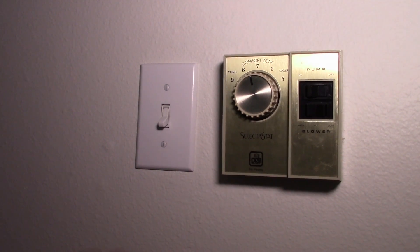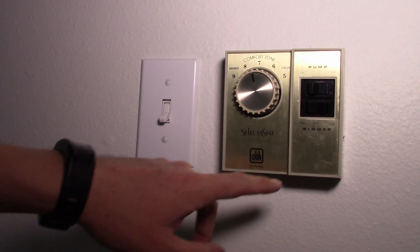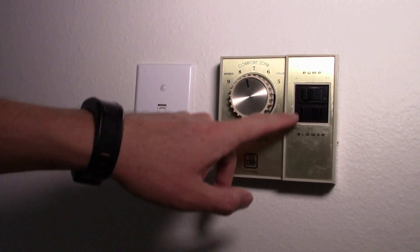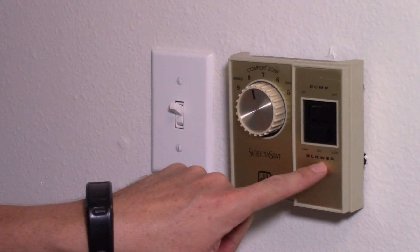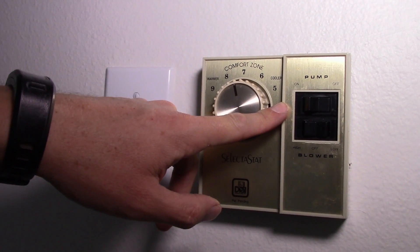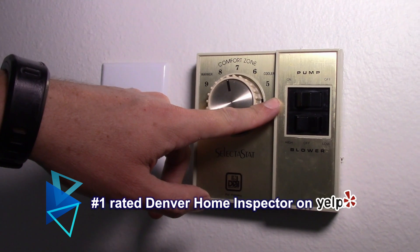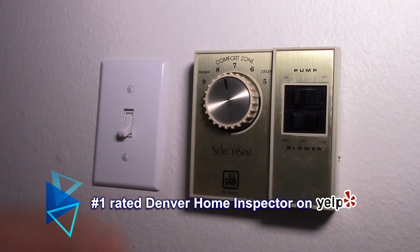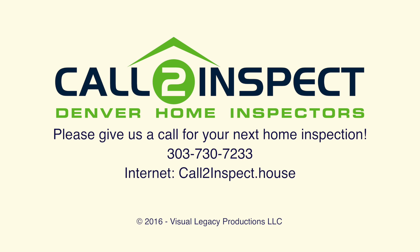This is the homeowner's operational control, which is right down here. This is a thermostat — you can actually set this for the unit to come on automatically when it gets warm in the house. This is the main blower control, high and low. And then this says pump on and off, which is if you ever wanted to run the unit without the water flowing through it, to just use it like a fan. So this is a pretty fancy control. A lot of these evaporative coolers just have one switch, on and off.